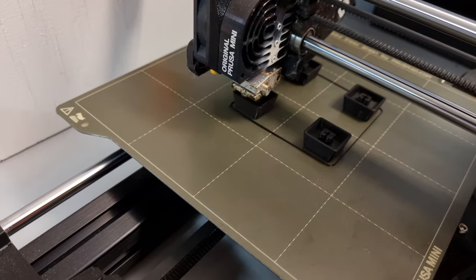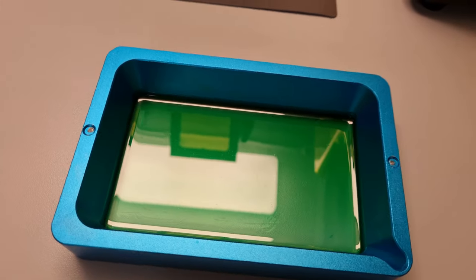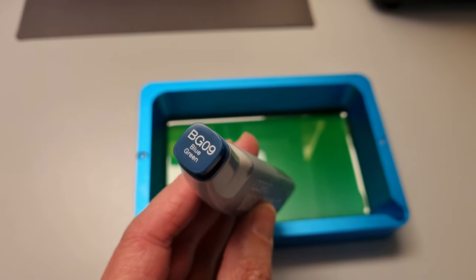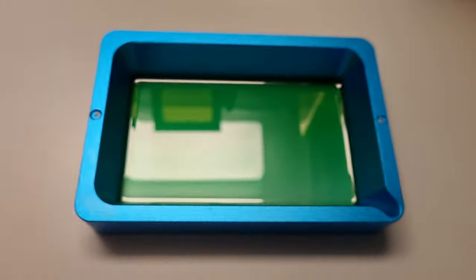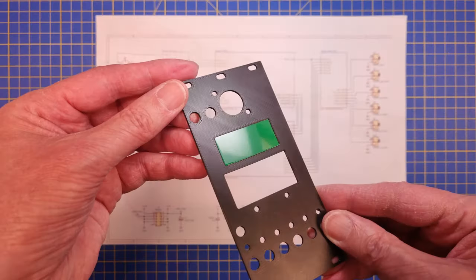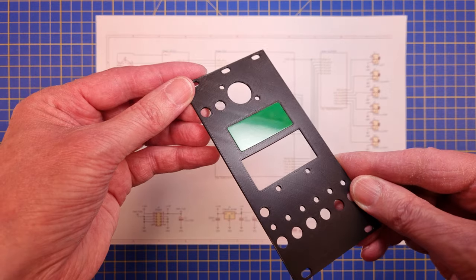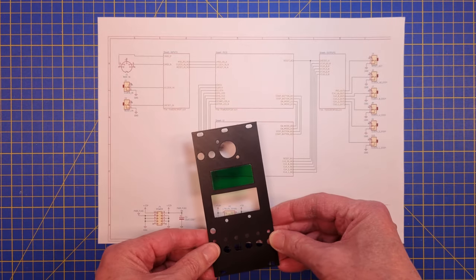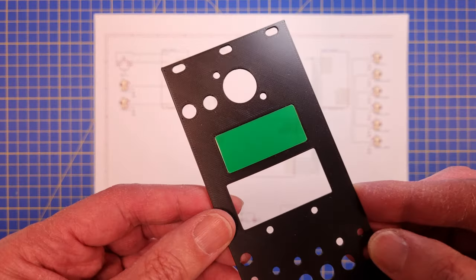The lens is printed on my Anycubic Photon using transparent resin that I have tinted with some green ink, since the 7-segment display uses green LEDs. The parts come out quite dull from the printer, so they are coated with a gloss varnish and polished to a sheen. I use the same method of surface treatment here as I used for the OLED lens in my base body project.